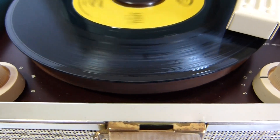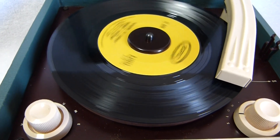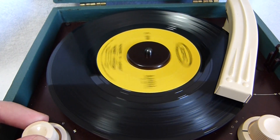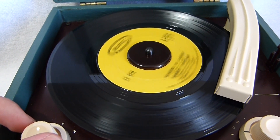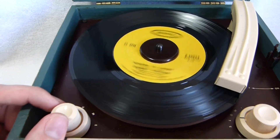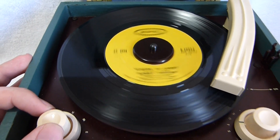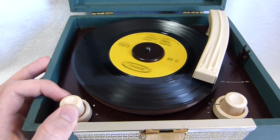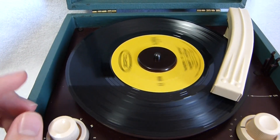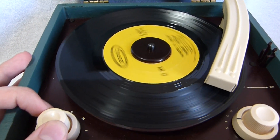There's a timing mark on the turntable. The amplifier has three very early Philco transistors which are socket mounted. To get this thing to play, I had to replace two capacitors — one electrolytic capacitor and one bumblebee-style paper capacitor.